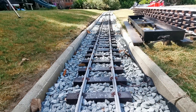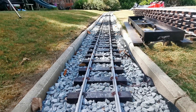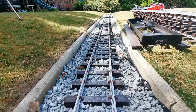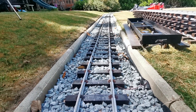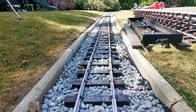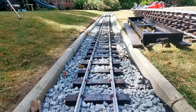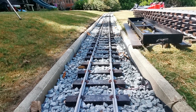By the way, I left it at the end of part three - I'd put all the remaining ballast into the centre between the rails and locked it down, recognising I have to come back and fill the shoulders in, which you can see are exposed. The idea is to fill a bit of stone to make it level with the sleepers, and perhaps lift areas that are a bit low. This section here, right next to the camera, is out for about six feet and needs lifting by about half an inch to an inch. I can feel the loco speeding up down this section, so it just needs lifting a tiny bit.